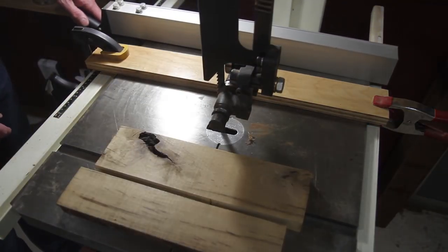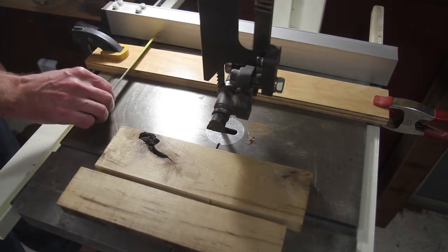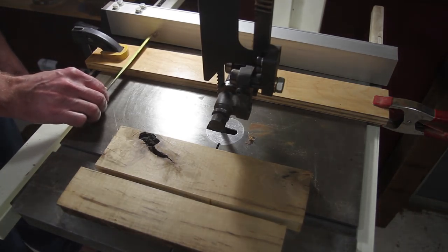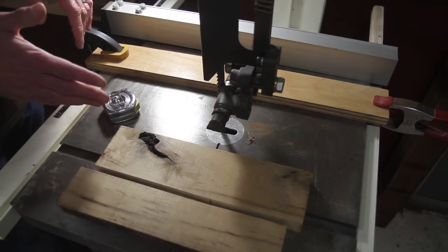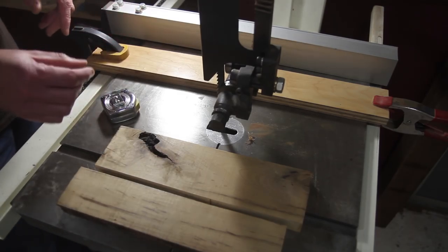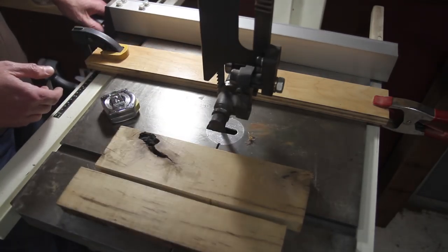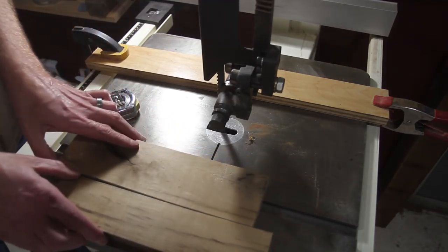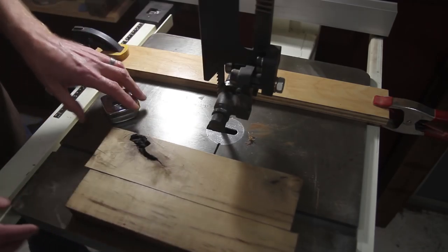If I bring the fence over, we're an inch, an inch and a quarter there and an inch and three quarters right there - so definitely off. If you want to saw some thin strips like veneer, you need to do the same thing - just make yourself a taller fence to support it all the way up. That is why in the video I was loosening that up as I was cutting through - it was following the blade. If you want to re-saw something, you need to set up a fence.